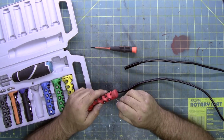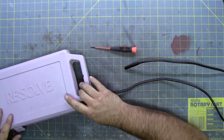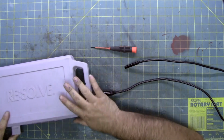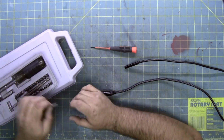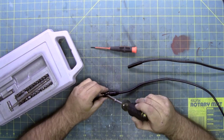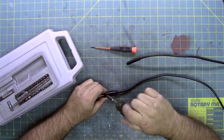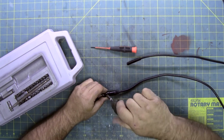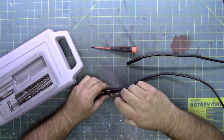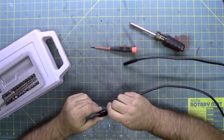Well, I am surprised that none of the kits I have in here are the right size. Try the one that's too small again and see if I can just get it to wedge a little. I want to try and pull this center hub out if it comes out. It may not. So I can try and repair that broken pin. Oh, maybe it is coming out. It is the right size. I must not have had it in the actual Allen itself. And there is the little Allen set screw. Make sure there's only one.